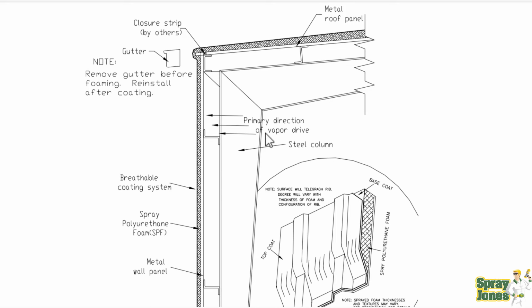And I think it's very valuable to see that, okay, if we're going to be putting closed cell foam to the outside, it's a great way of leaving the inside completely untouched, warm, and you've got this beautiful virgin interior that you can do anything with. Plus, it eliminates the issues of how you're going to get foam into some of these difficult side details and corner details.